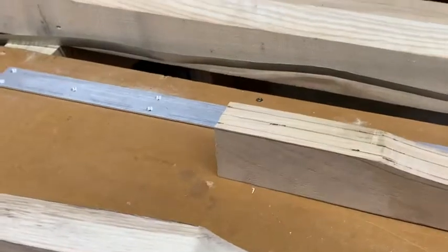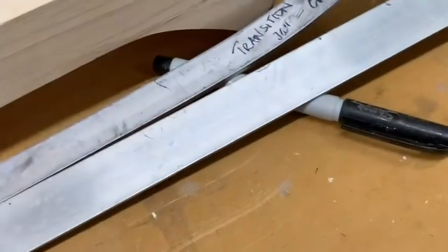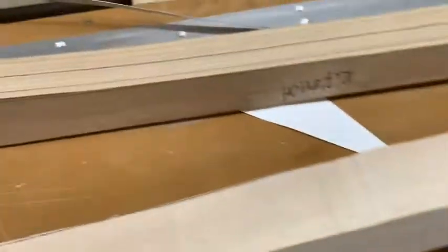I think you've seen in an earlier video, John Hudson and I were kind of playing off of each other, and he kind of got me into using the ball peen hammer. I still put a piece of packing tape over the bottom eye of the axe. And I take a little Sharpie like this, not the big one, a little one, and I mark the center lines. Then I take the ball peen hammer, and that ball peen hammer scores, and it gives you a perfect carbon copy of the bottom eye.